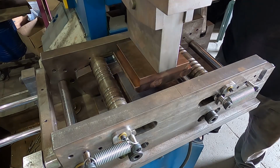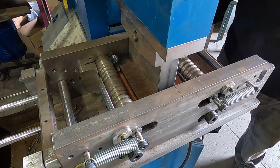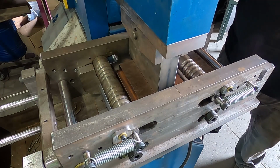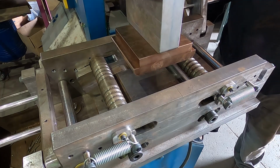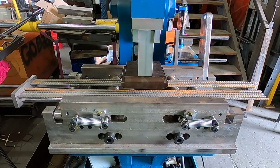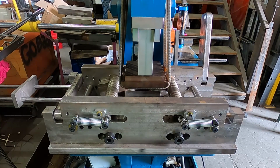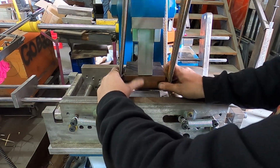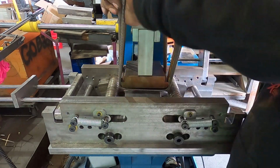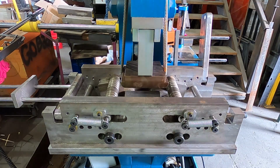After the rebar is mostly bent, they get pushed against the bottom plate that straddles and pushes on the bottom rollers. These rollers swing the side arms, and the arms push against the top rails, reducing the distance between them and bringing the legs of the rebar to the desired width. The depth of the stroke can be adjusted to compensate for spring back of the rebar and to achieve the ideal angle of the legs.